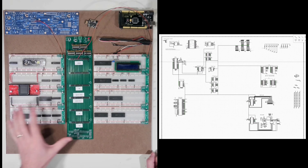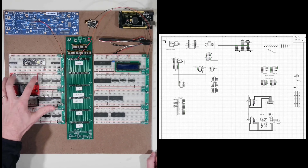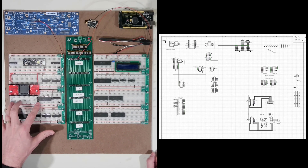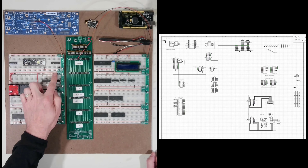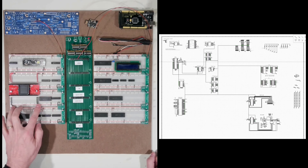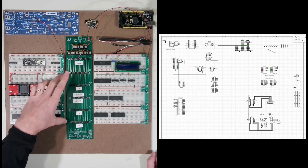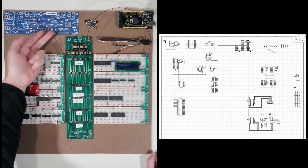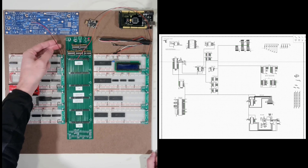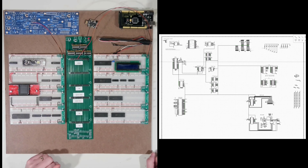To get me started, I do have all the chips laid out and I have connected power to each of them. In the case of the processor, I've actually got five power lines coming in and five ground lines — really four pins for power and four pins for ground on each of the rails. So it should have a pretty solid connection as far as power. I'm using these PCBs to distribute. This is a single piece PCB that distributes power, and this up here will connect into the power distribution board. I'm just using for now a 22 gauge wire that comes into this and distributes out, but that should be more than adequate.